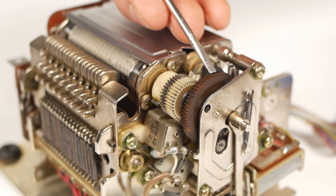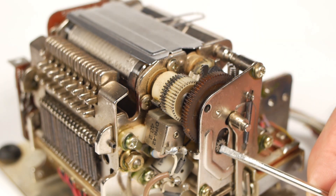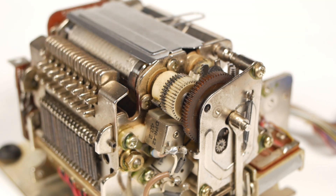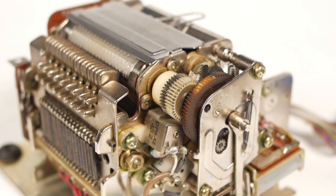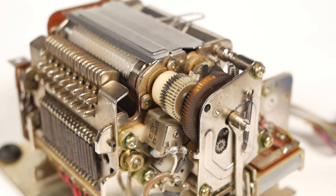This gear here is the offending one. You've got the motor pinion at the bottom which drives the strip gear, and on the back of the strip gear is a smaller gear that drives this final gear that's attached to the number drum. The strip gear doesn't look too bad at the moment, but if I rotate it a little it's in a pretty sorry state. It appears to be made of a material that's decomposed, because you can literally break teeth off it with no effort at all.